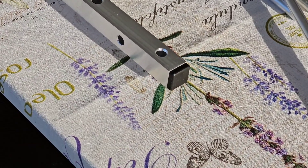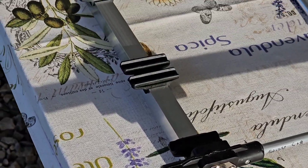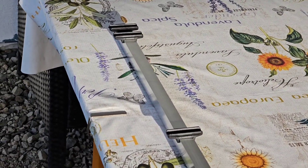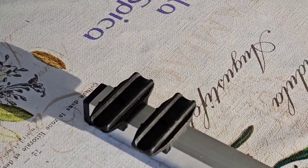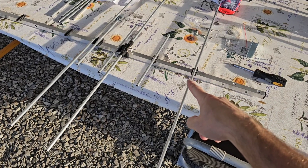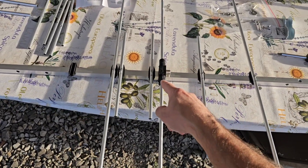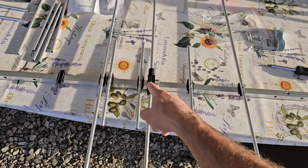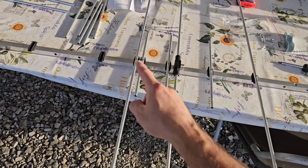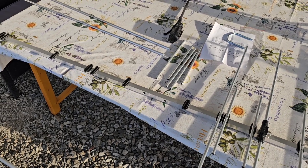The plastic cap is on top, the holders are attached, and on the second side of the boom is the plastic cup and the reflector. That's the 70 centimeter reflector. This is the driven element for both 2 meters and 70 centimeters. These are the directors for 70cm and 2 meters — director number one — and I need to finish the rest.